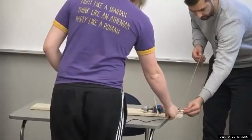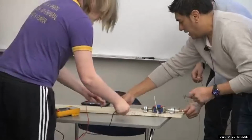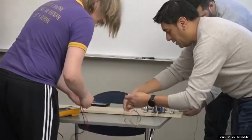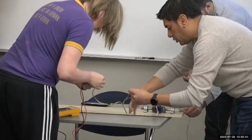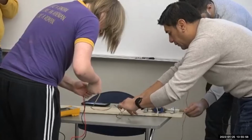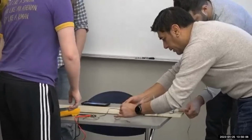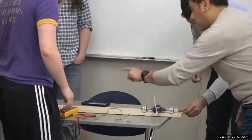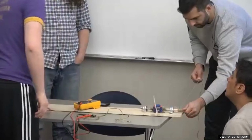Okay. And here, maybe we can move on that side so we don't block the camera. Yes. Over there. And here I have this connector. This is going to be there. So from the other side, there. And here we will have one terminal of this coil connected here, and this is the other terminal. Because this is changing, this is a very simple setting, basically. We are measuring AC voltage. So in this instrument, we're measuring the AC voltage, and just keep turning this, and look. We are already measuring some induced voltage in these little coils.